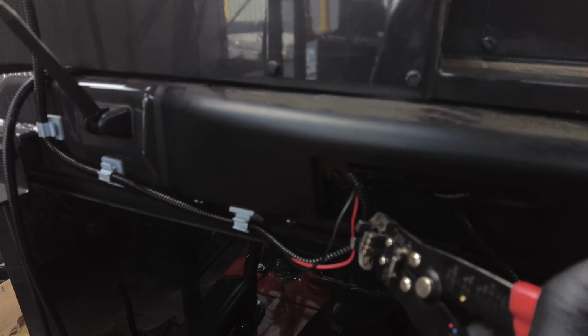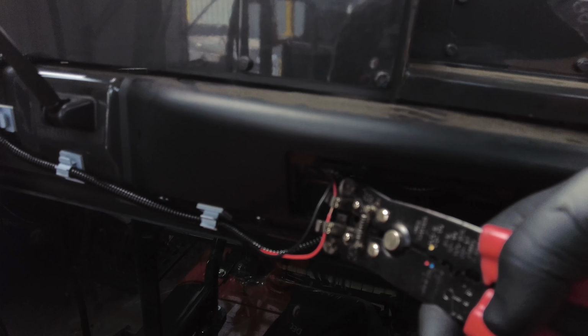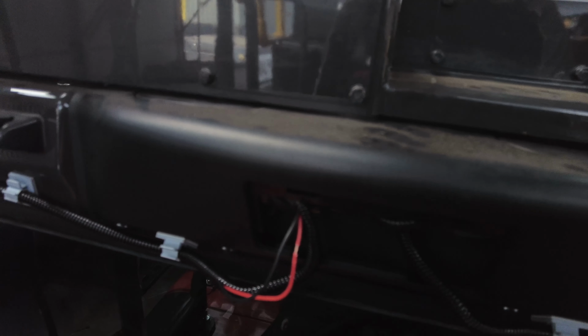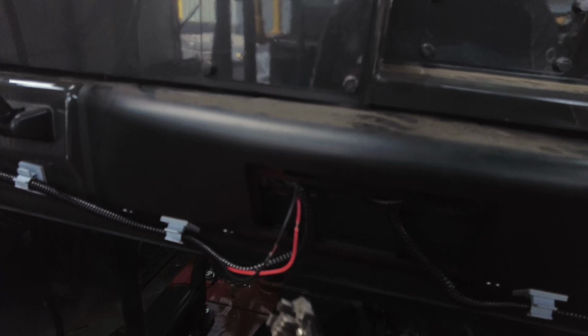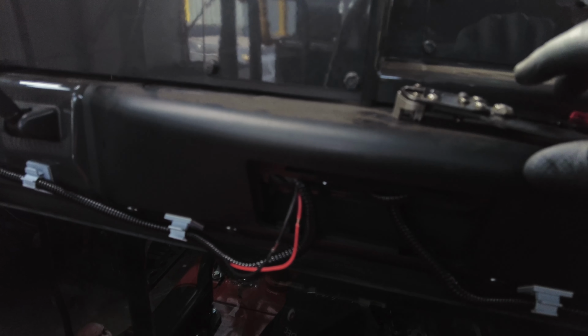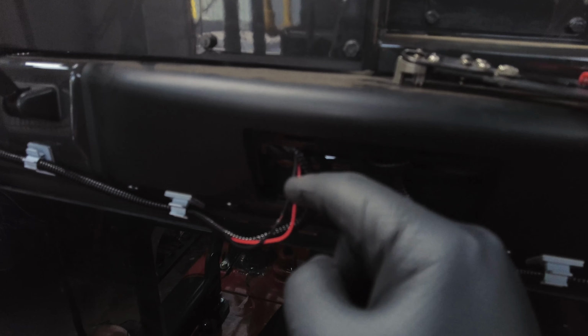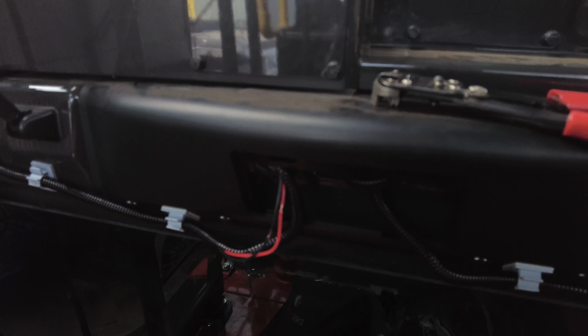Sometimes the wiring's different. If you use these grippers here, what we're going to do is just split the wiring open like that, and all it does is pull back the armour, and then we'll do one down here. Obviously it's important that we don't just do both together, we'll have to have them staggered so they kind of join together, or if the tape ever wears off what I put on, you don't want it to ever short circuit through there and knock the beacon off.